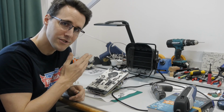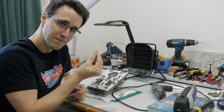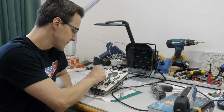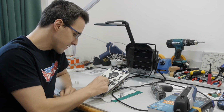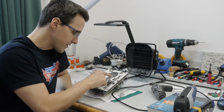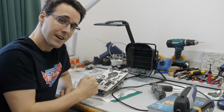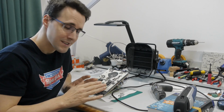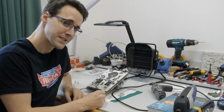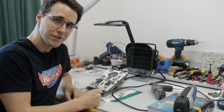Damn, I hate those cheap switches. I'm preparing these switch caps here from these aluminum shafts, and the aluminum tube fits over these switches here, but it doesn't fit over these here, it can't get over. The diameter of the shaft of these three switches is a little bit bigger than at the other ones here. They come from the same package, but they are a little bit different. So I have to do a small operation and sand a little bit of the metal away from the switch.